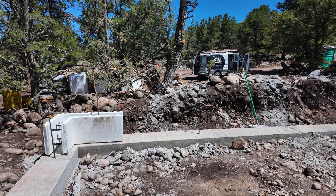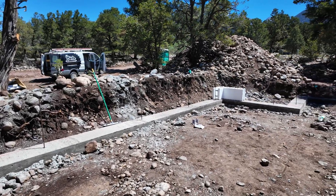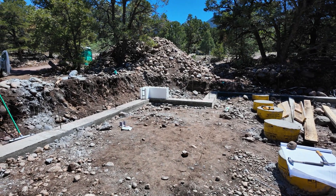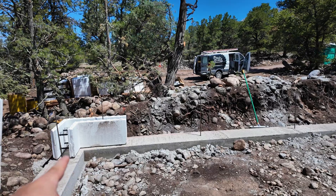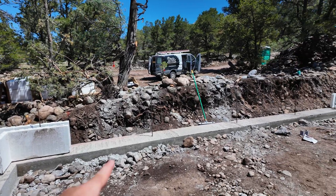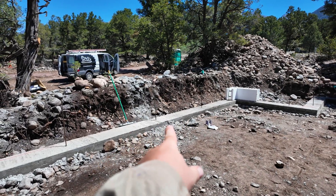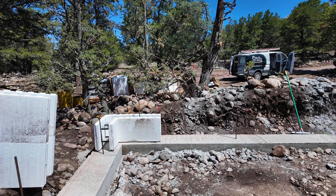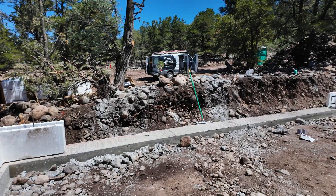Getting the Fox Block set up — I always like to take my two longest and straightest walls and start with those. That helps with getting everything aligned, but putting the chalk lines down already helps too. First thing to do is always start with your corners. I put my corner down there and my other corner here. You don't start on one side and go to the other — your blocks will be all messed up when you get to the middle. You always start at the outsides and build your way in until you get the little seam in the middle, cut that one out, then move the corner and do the same thing working down.